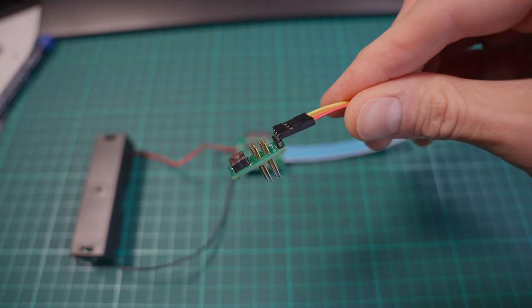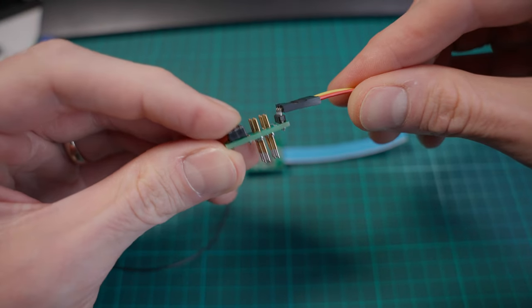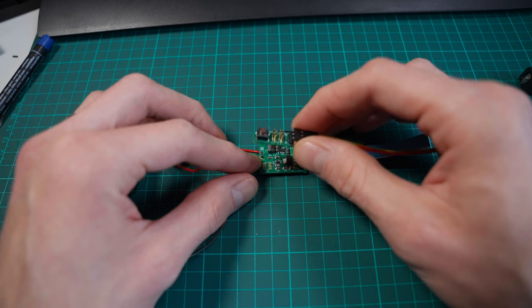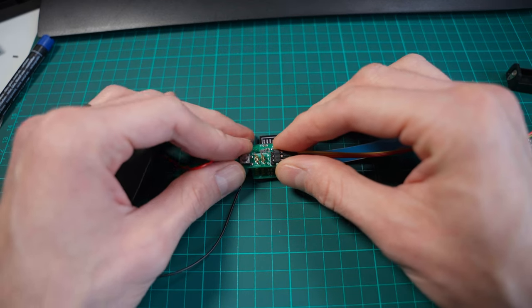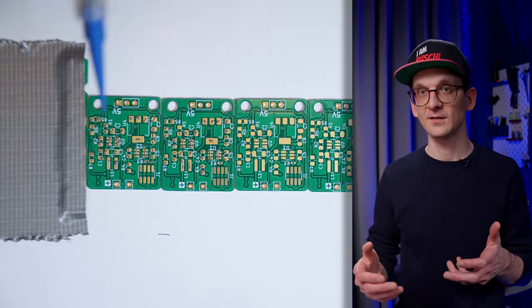I also created flash PCBs, which are essentially a small PCB breakout of a cable. They can be connected to a cable and pogo pins can be soldered in place, so that you can hold the flash adapter onto the board, press the button, the ESP resets and goes into flash mode, and you can flash it. Then you forget about this and never go back to it — hopefully — because you can update over the air.